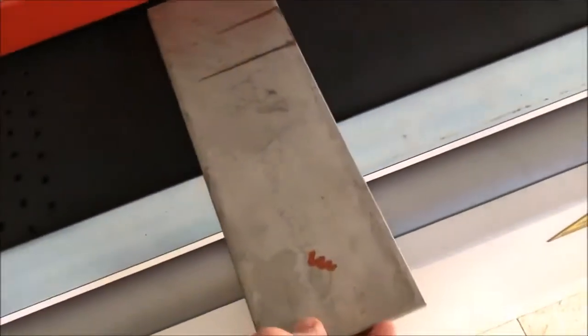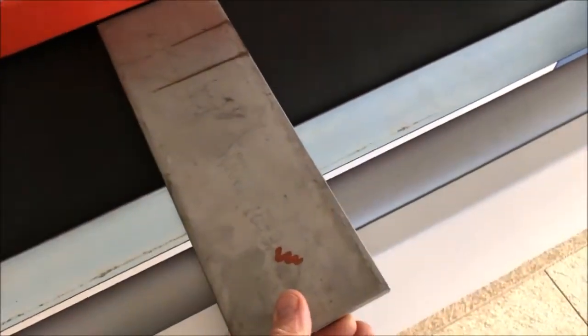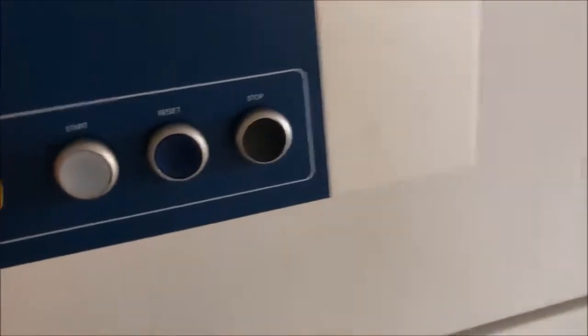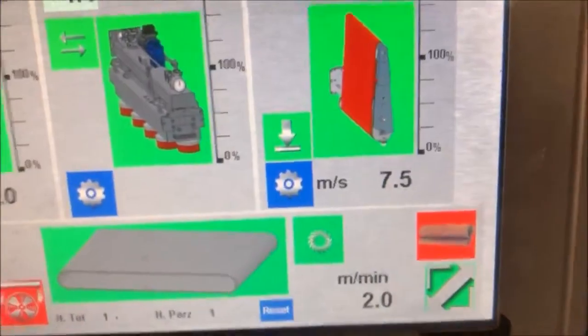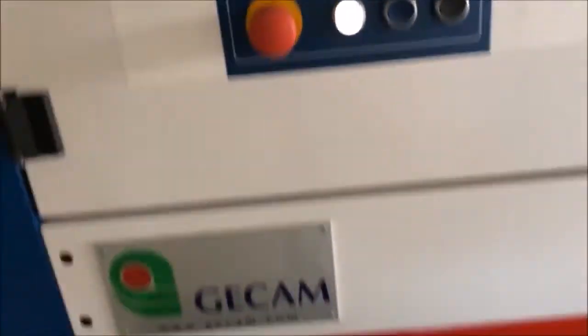The material thickness is essentially the same, it's 3/10 less. So all we did is I'm going to pick a new part on the machine so that I have a fresh piece of belt. All I did is I brought the material thickness to 9.7 because it's 3/10 smaller, right? And actually we sped up a little bit of the finishing belt in the back to get a little bit more there. Again, we just hit the starting button.